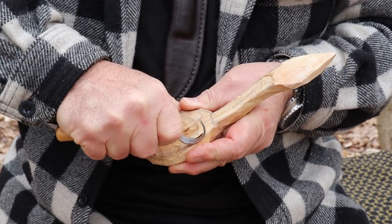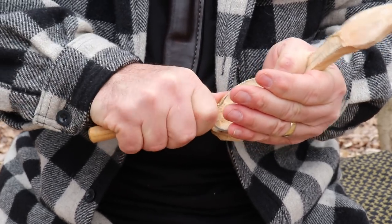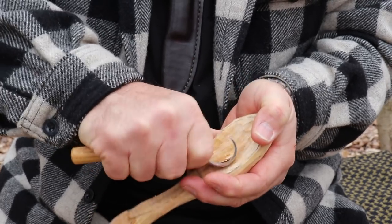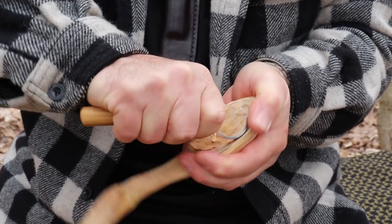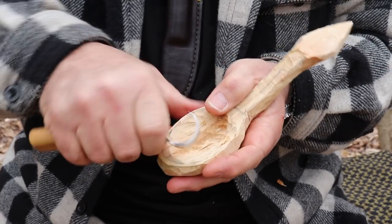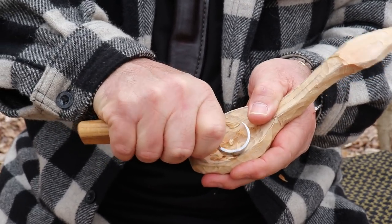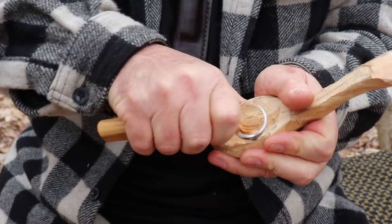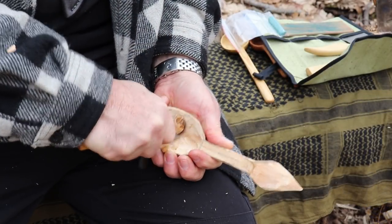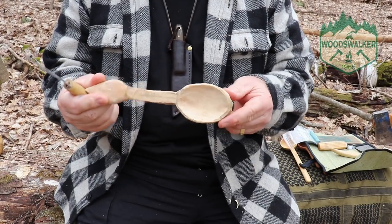Here's the tool that most of us are probably interested in — the little hook knife. These are high carbon steel and they take a really good edge. As I was using them I would just strop them, and if I let them go too far they came up really easily with some sandpaper. It's great that a strop comes included. As you can see, it's making short work of this birch bowl and I could have this hollowed out in no time.